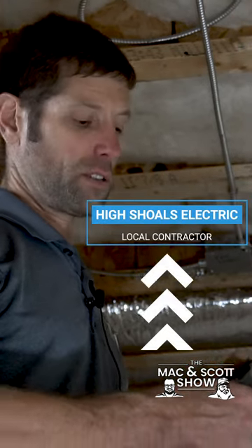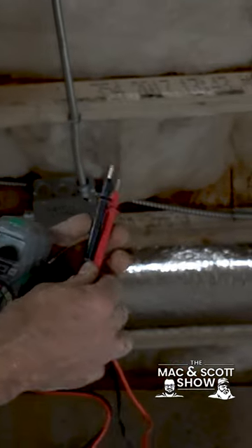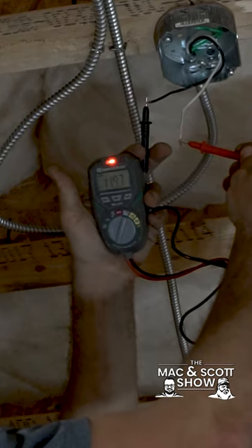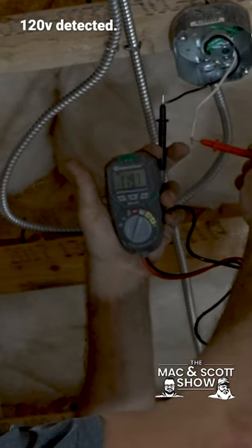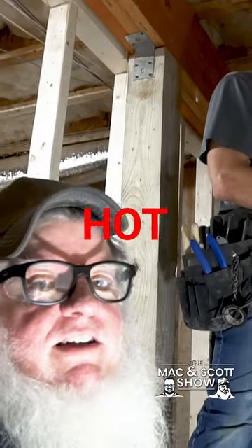It'll give you the actual voltage. What you do is take your multimeter, set it to volts, and then take either of the two leads and touch it to the wires. We're at zero volts now. When we touch the hot to the neutral, we come up to 119 — so 120 volts is what we're looking for. So we know the circuit's hot. Now I cut this off at the breaker, so let's see what it looks like when it's not live.